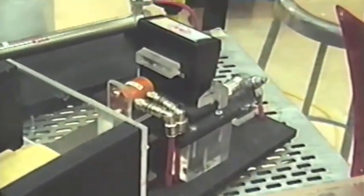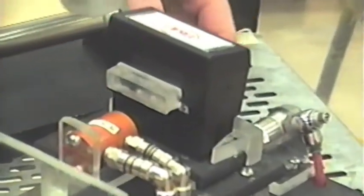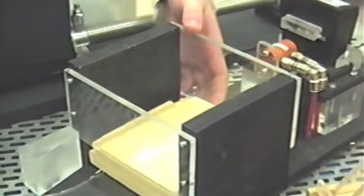Our bottom fixture. It just holds the bottoms until the robot is ready to pick them up, put them in the CD rack. This is our stamp fixture. It holds a stamp in place by a cylinder, and the limit switch verifies its position.